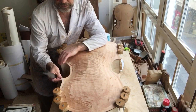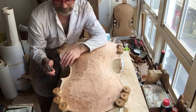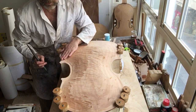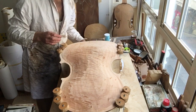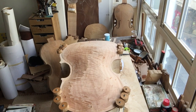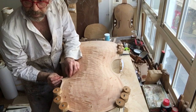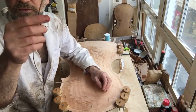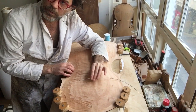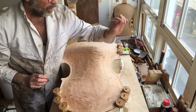You remove from here first because you have this curve moving both ways, and both sides are going to terminate into what they call a bee sting — that's where the purfling comes in. If you have something that's not elegant, when you inlay your purfling — which is three pieces of wood — it's going to accentuate the ugliness and pop out. So you spend a lot of time on this; it's important.